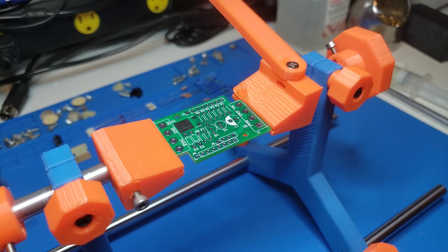I'm not doing the add-on board here. First of all I built my own power supplies and I'll leave links where you can build your own — you can build one really cheaply with two wall warts that you can find at a place like Goodwill. I'm doing this because a lot of folks are sometimes flippant, saying you got a new Commodore, dump the old power supply, it's going to be bad, buy yourself a new one — thinking you can just throw out 60 or 50 bucks and buy a new power supply. Some people are on tight budgets and don't have that money, so this will protect you from those spikes.